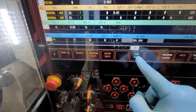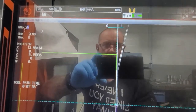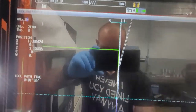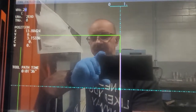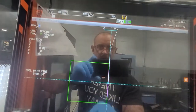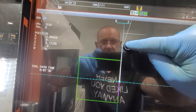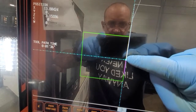Then we go program, and do path continue. Let me clear this up — if you want to clear the lines, you do path erase. Once you do path erase it's going to clear the lines. As you see, it didn't do an angle — now it came straight. Let's zoom in higher, more magnifying. As you see, it came from the top, 10 inches here, and then came straight to the point. And then it just retracted and went back home.